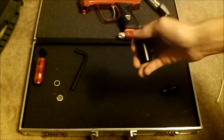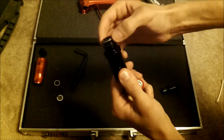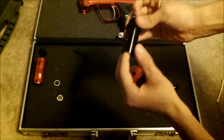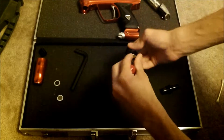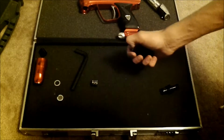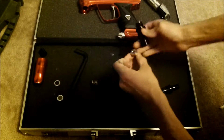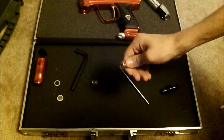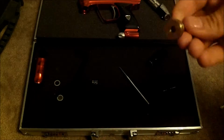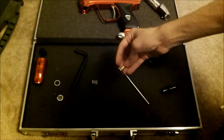And then here, this is our top half. You just have the O-ring on the outside, O-ring at the top. Nothing really on the inside besides the threads. You're going to have that little spring come out of you. And then I'm just going to take the back of this and just kind of pop this piece out. And then you have this O-ring to deal with. And that's pretty much it. That is as far as you need to go as a user for the regulator.